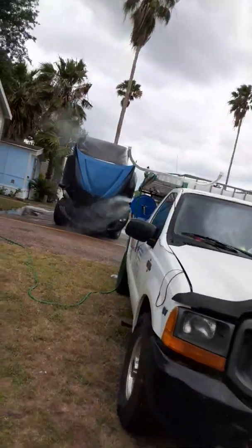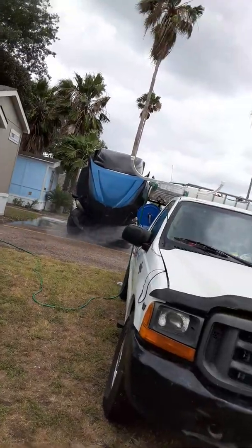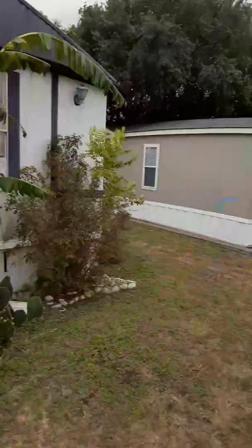What's going on everybody, Moises Foss with Foss Power Washing LLC here in Corpus Christi, Texas. Today we are doing a semi wash for one of our family members, but in today's video I wanted to show y'all our force-feeding setup — the way we got it set up to get water from our 275-gallon tote to our pressure washer. A lot of people use gravity-fed; we like the force-feeding with our 5.5 gallon-per-minute pump. It's a NorthStar 12-volt pump.